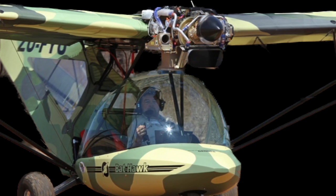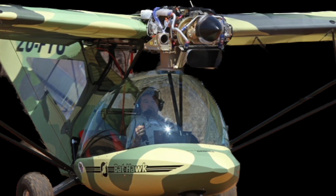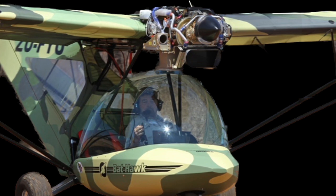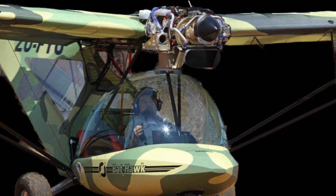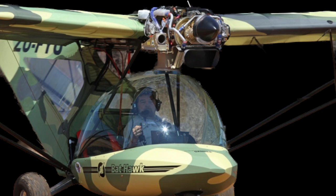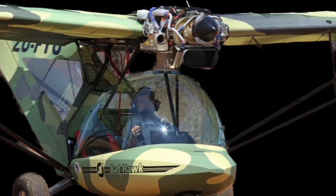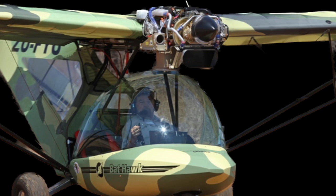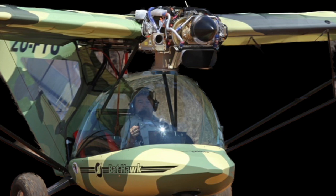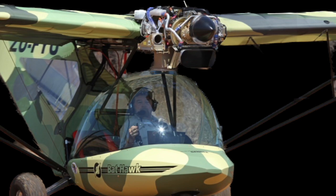The original oil tank was built with an oil pickup tube that goes through O-rings and is mounted to the oil pump behind the alternator. This pickup tube works fine as long as you have good oil pressure throughout the flight. Another style of pickup tube had a bung welded to the top of the tank and a rigid aluminum tube going to it. The pickup tube part that is now inside the tank has had a failure, and there is a service bulletin on it.